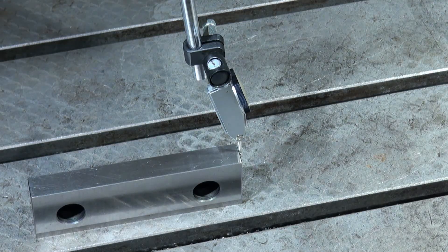The X-axis in this machine has about five ten-thousandths of an inch of backlash, and we put five ten-thousandths of an inch of backlash compensation in the controller, and we end up with zero backlash. When I got the machine, that wasn't the case — I had backlash in the screw to the tune of about a thousandth and a half, which is a fair amount. I was able to troubleshoot it, and in this case it was not the ball screw, which was good — it was easy to fix.